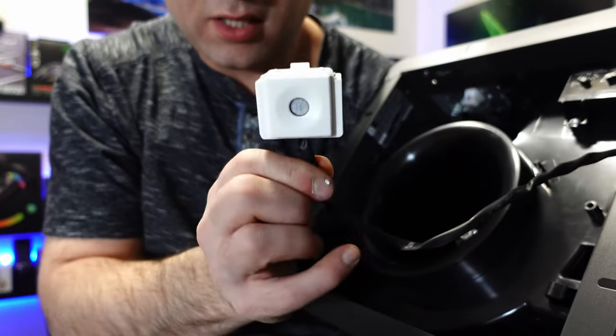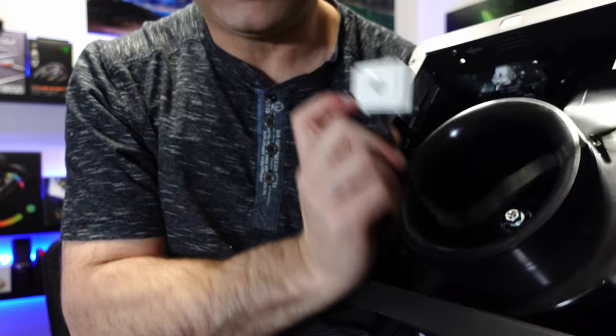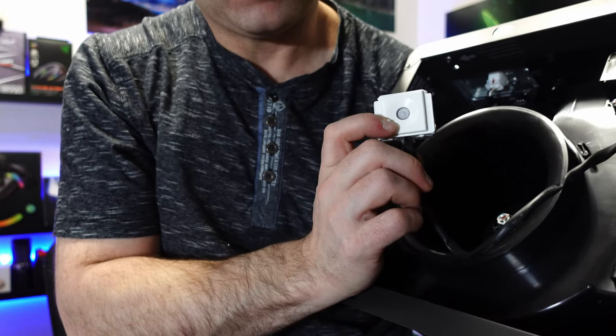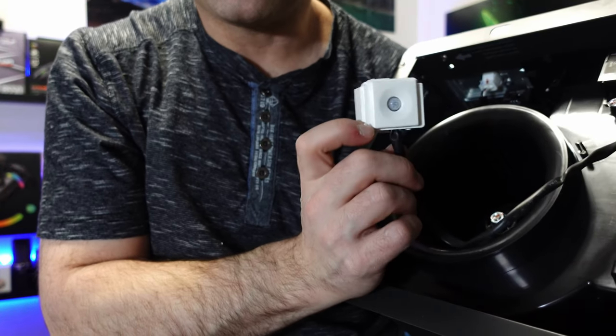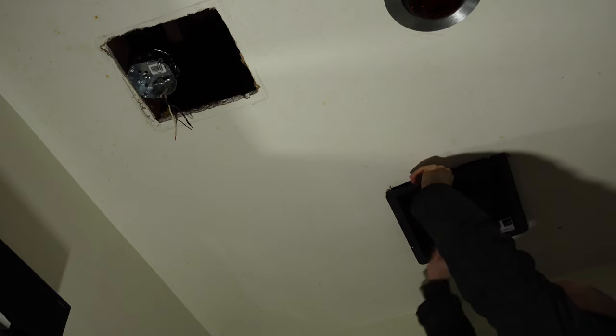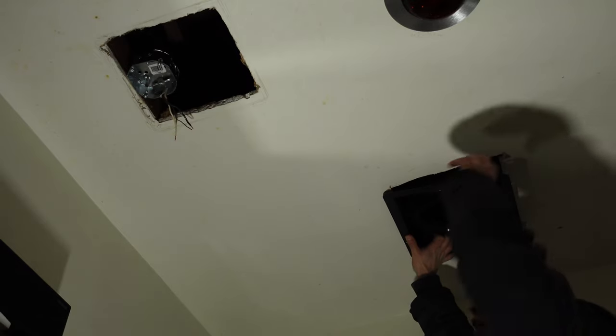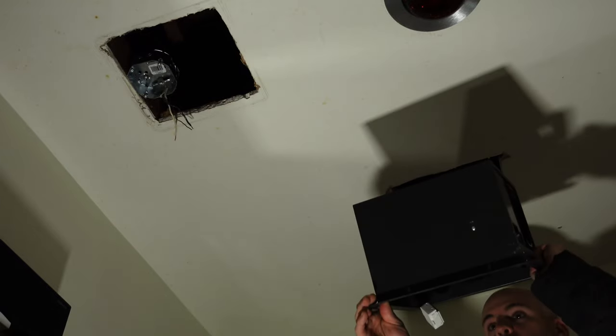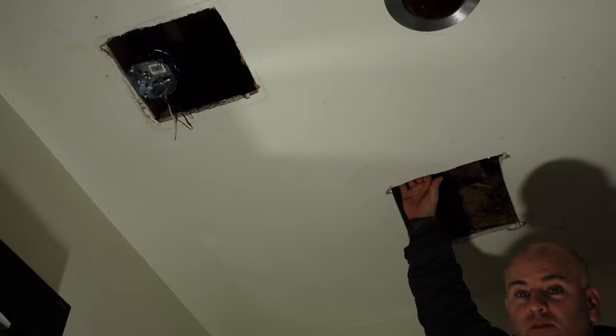Right here that was taped down is our motion sensor. That's going to go underneath our little plate so it can actually be seen. If the motion sensor is too sensitive, you can always try covering a part of it with tape or maybe a little bit of whiteout on the side. Right now what we see are two different holes. The old ceiling fan is right here, but now I'm putting it over the shower. I made the hole bigger on purpose. Since I have drywall, I can't use that Z-flex mounting bracket. I need to leave a gap so I can put the vent properly into place. I have wood right here, and I'm going to mount the screw holes to the wood, then use another piece of wood at the front and put screws through to give good bracing.